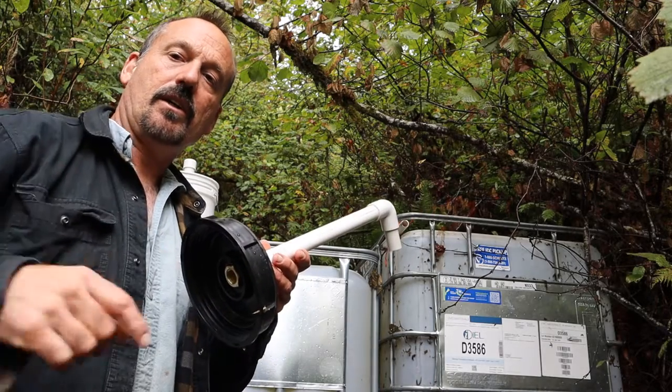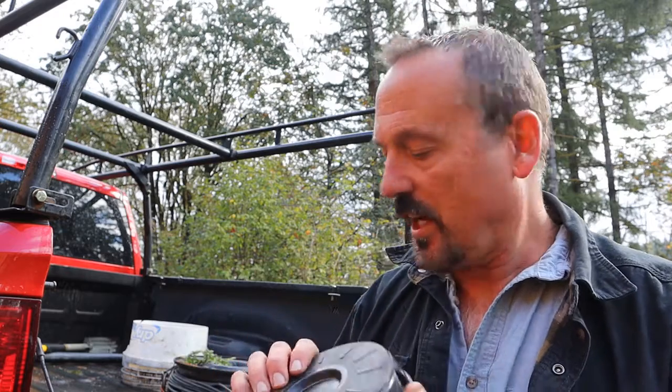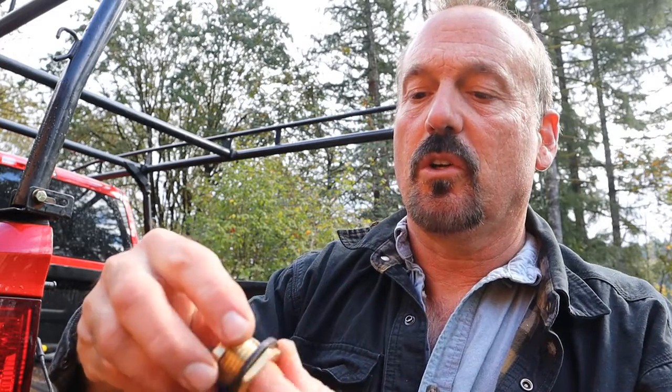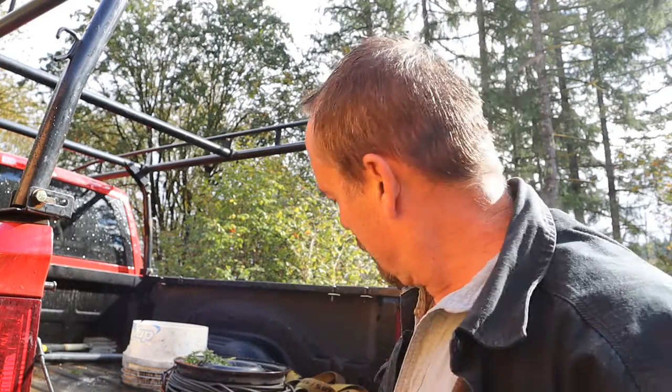I pre-built this already down below. Here's the video on how I put this together. In trying to create my venting and leveling cap, I have the cap that goes to the IBC tote. It's pretty thick strong plastic and it's nice and flat on the top. So if I drill a hole, I can put this — some people call it a bulkhead, they're calling it a cooler drain. What this is: you drill a hole, you stick it in, there's a gasket that seals on the inside, and then there is garden hose thread on one side and a half inch or three quarter inch pipe thread on the other side, so you can connect to regular piping. We're going to go ahead and thread in some PVC pipe to make it work.